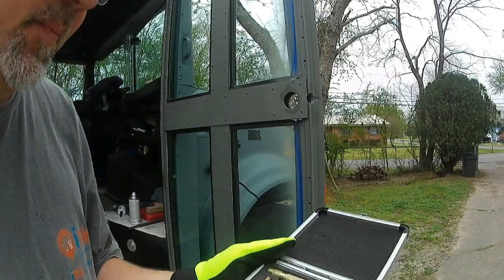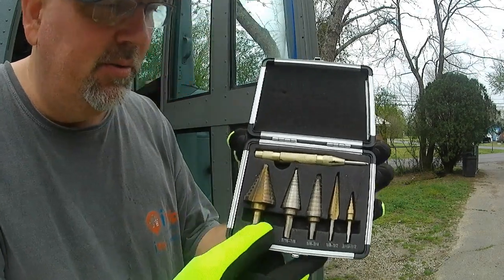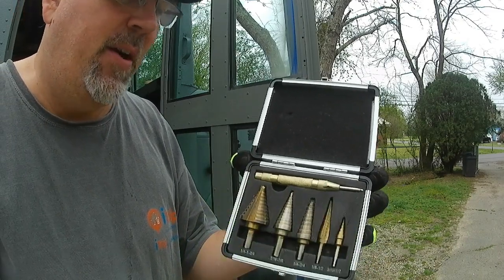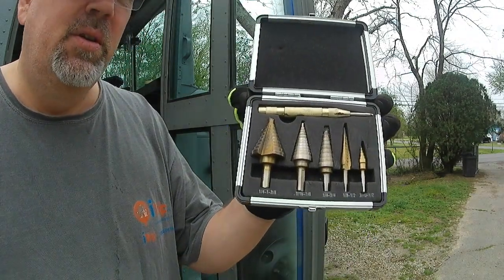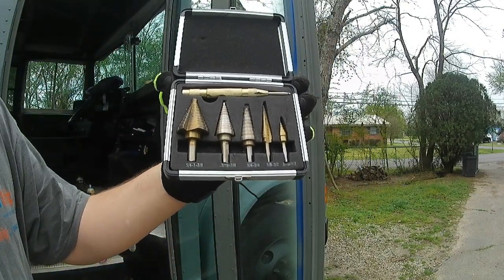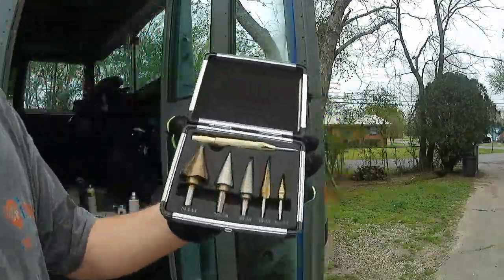Tell you guys what, this right here, this tool right here, this can't be replaced either. I got this for like 25 bucks or something off of Amazon. These are step bits, comes with a center punch. I'll put the link in the description. This is a really good product, and it allowed me to be able to put that hole through the side, which I never would have been able to do with anything else.